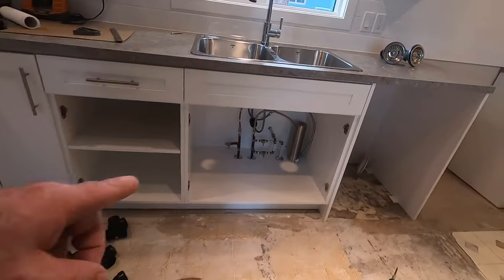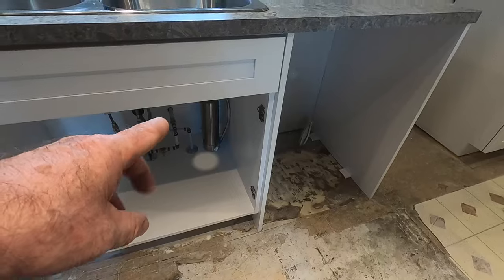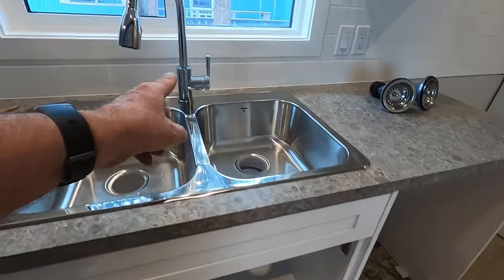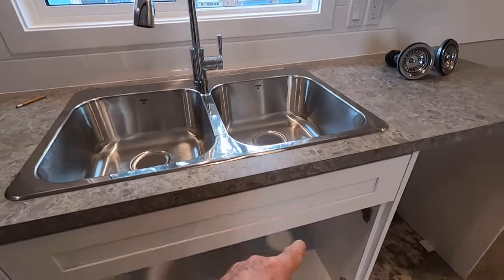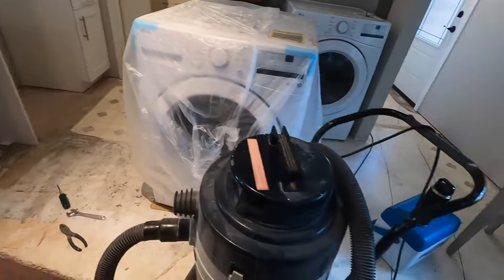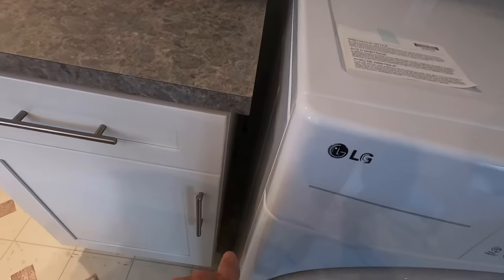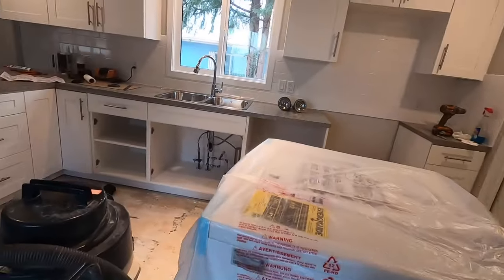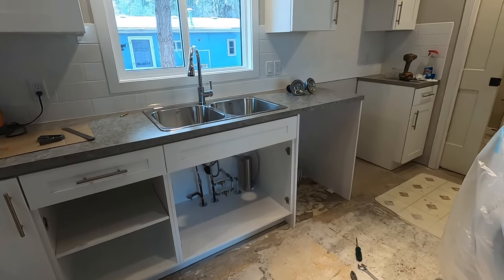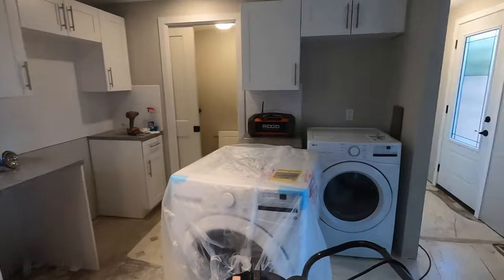From there it just distributes throughout the house. That first filter is more of a particulate filter — it just gets the sediment out. Then secondarily we have a different kind of filter here which takes out more microns of stuff. It's not a reverse osmosis, but it takes out a lot of the fine stuff. We put it on the cold tap side, so if you're going to cook you'll use filtered water from the cold side. For washing dishes it doesn't matter. In the fridge area, we have a pipe that's going to feed water to the fridge — the fridge has its own filter, an ice maker, and chilled drinking water. That water for drinking and ice will be filtered in the fridge.